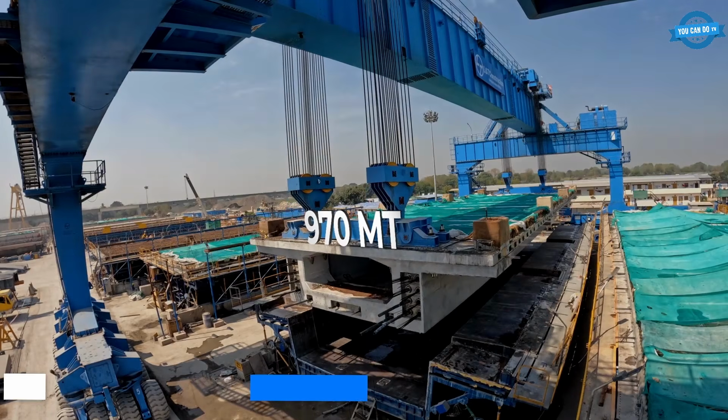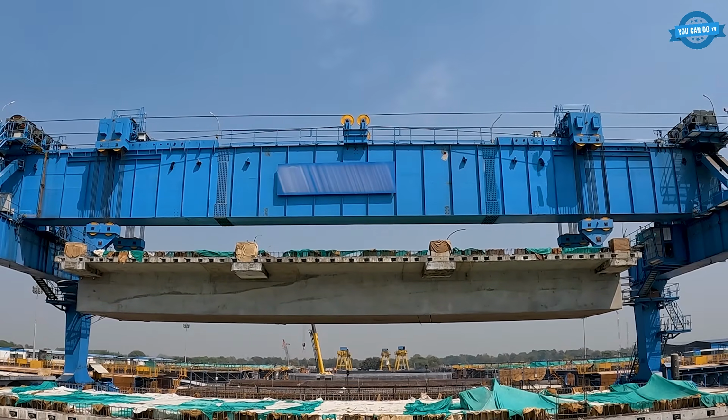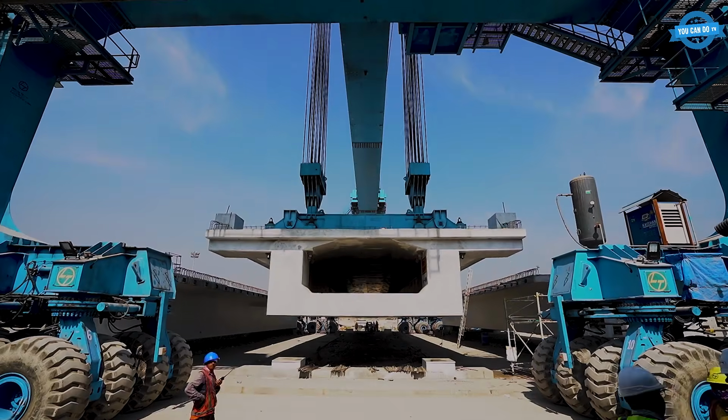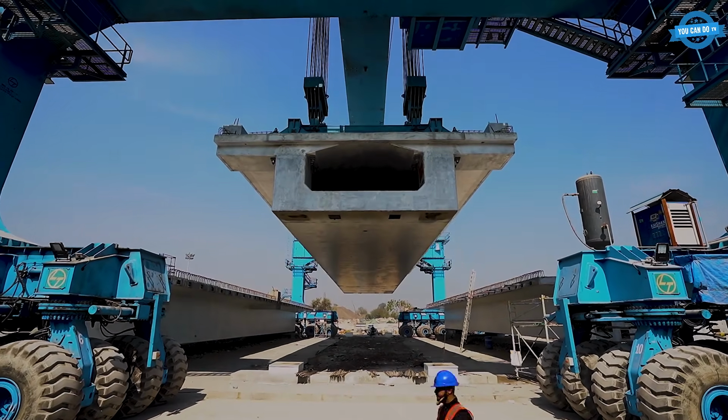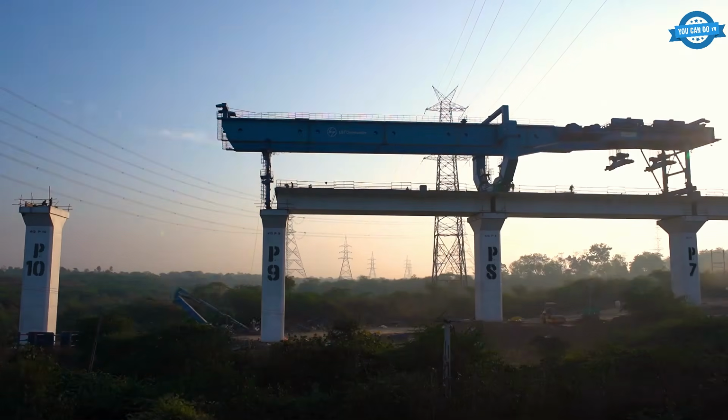The real trick with a box girder is what you cannot see from outside. The span is hollow. That empty core keeps a 40-meter piece from doubling its own weight. The hollow shape stays extremely stiff against twisting, which is exactly what a train doing 300 kilometers per hour wants under its wheels.